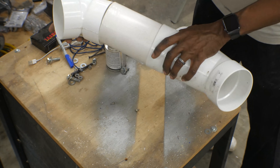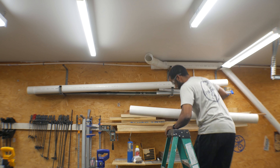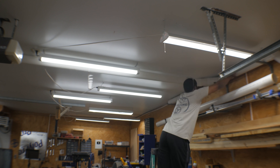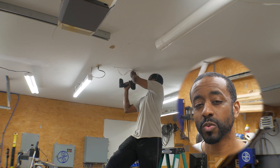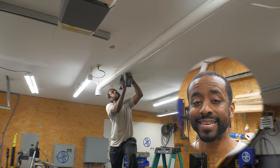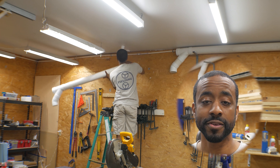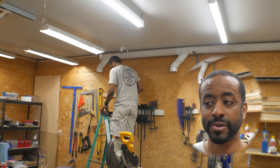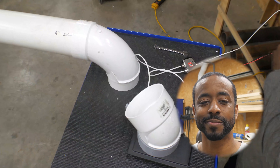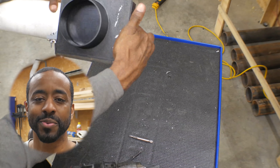There are a few places where I put some PVC glue, but for the most part all of the parts are dry fit together. The PVC pipe I'm using is the thinwall sewer variety — much cheaper, but just as effective. Bob's also got a great video on his dust collection system, which is also automated with an Arduino setup, so I recommend you check that out. There's one more topic related to PVC and dust collection: the possibility that a static charge can build up on the PVC pipe and possibly ignite the sawdust. I've investigated this topic and can't find a single documented case of a static charge on a dust collection system causing a shop to catch on fire. I personally don't think it's a realistic concern, but I will add a grounding wire if only so that my neighbors aren't worried about my shop catching on fire.